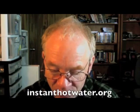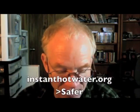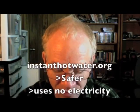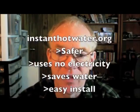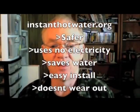The problem is, now when you go to drink or cook, or even use your ice maker or water from your fridge, you get recirculated water which comes back through the cold line. So recirculators pollute the cold water, wear out your heater, use more energy, and need to be wired in and wear out. Our direct line hot water system actually saves energy, doesn't add any heavy or sacrificial metals to your drinking water, and doesn't wear out. So that's the difference between our system and a recirculating system.